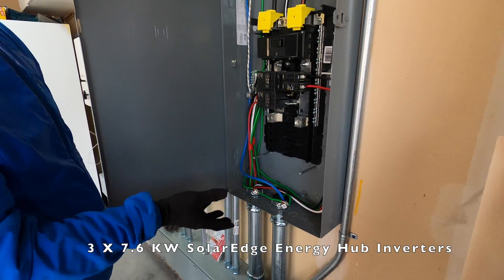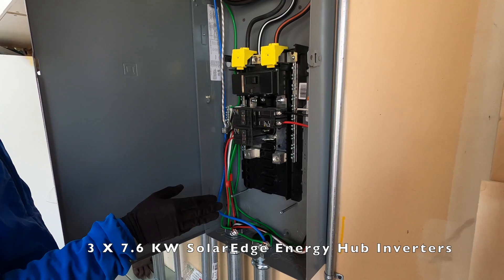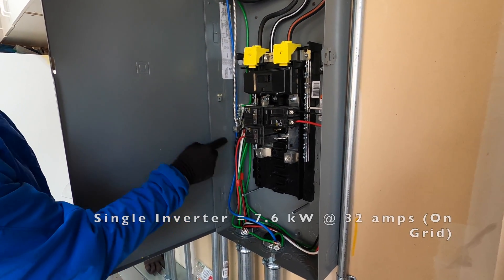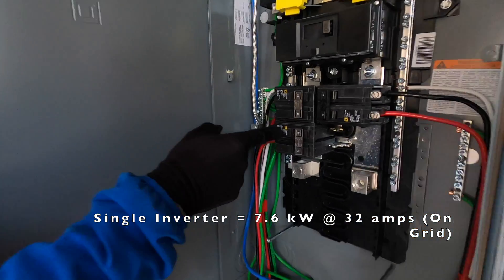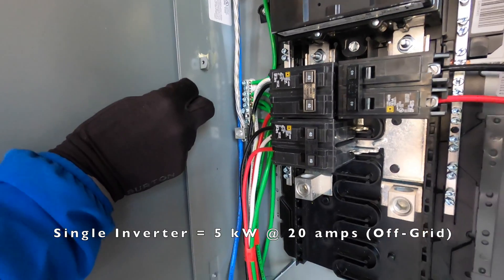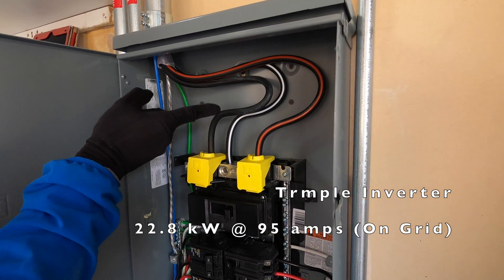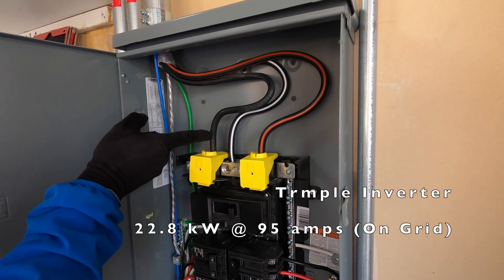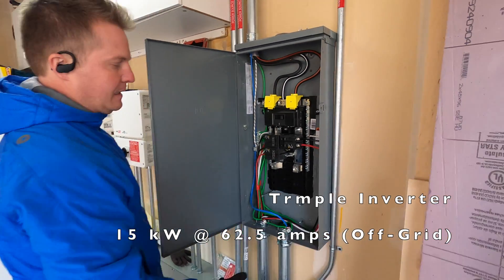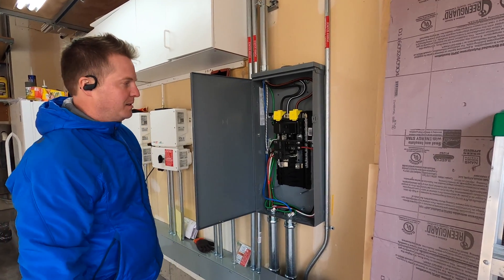What's all going on in this combiner panel? This is just combining all of the solar inverters we have on the site — we have three here. For comparison, most homes that we install solar on have just one of these, which is a 40-amp breaker with 8-gauge wire — that's kind of the maximum output you're going to get out of that. On the flip side, having all three combined, the output is much greater. We've got a much thicker gauge — I believe this is 2-aught — which goes to a disconnect for the utility. So you've got a lot more going on, a lot more complexity, but also a lot more capability on this particular system.